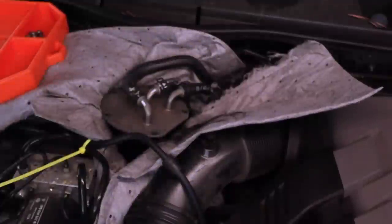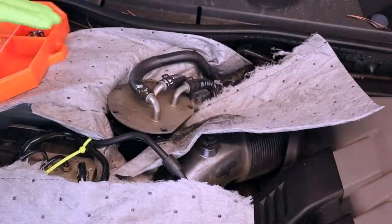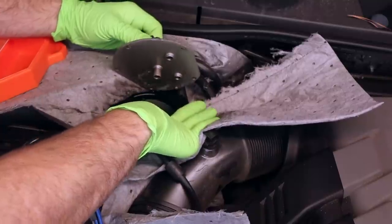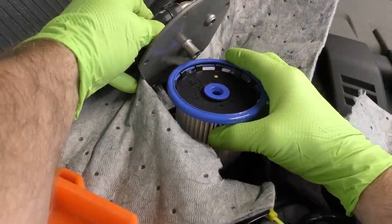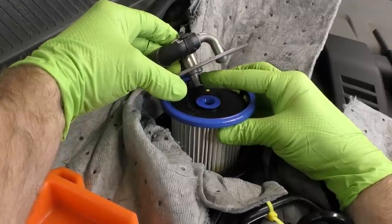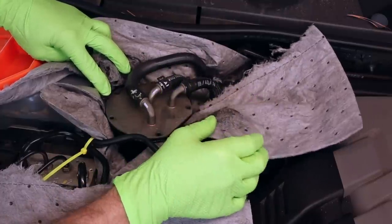We'll go ahead and grab our new filter here. Sometimes these come in plastic bags — I like to leave them sealed until I'm ready to use them. Go ahead and open that up. Before you put the new filter in, we want to take a look down in here and look for any contamination, any metal, any organic matter. Now if you find you have a bunch of yuck in there, you need to get that cleaned out — simply drain the housing, wipe it all out, and then refill it with diesel fuel. We also want to make sure before we put our filter in, we get a little bit of diesel fuel on our finger to lubricate these seals. Then I set the filter housing in very slowly so we don't overflow the housing. As I'm setting the lid down, I want to put the feed side — this pin in the middle — into the blue seal. Then very slowly put the filter in. If you do it too fast, you're going to splash diesel fuel all over the place.